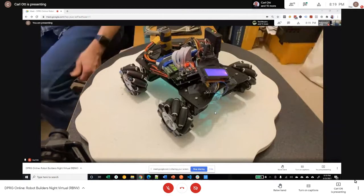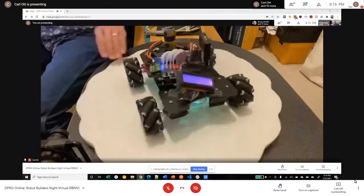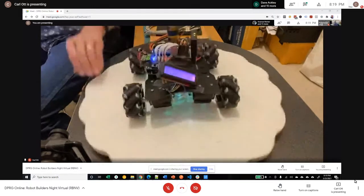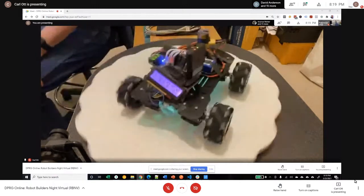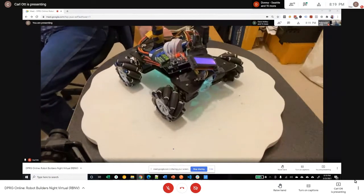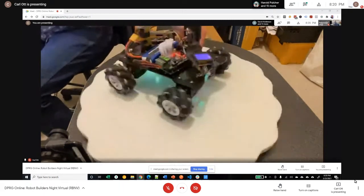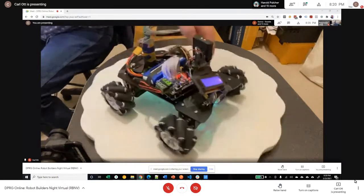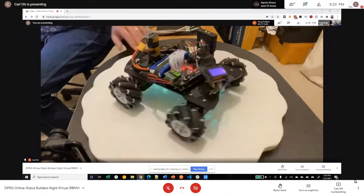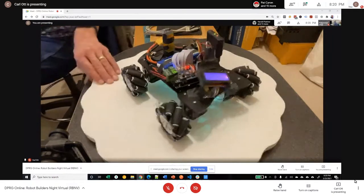Well, I have a set point 10 degrees to the right of north. But I found an interesting thing where you can see that it's got to get tuned. It's not very accurate right now. But you can see that it's pretty good. All right, it'll keep up with it. Might even walk off the table, find its way home. But there's this funny problem that happens. You see that glitch? So right at the zero crossing, when the heading transitions from 360 to zero, you can maybe hear it better than see it in the video, but I've got something going on I have to trace down.